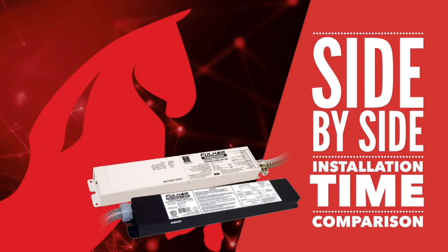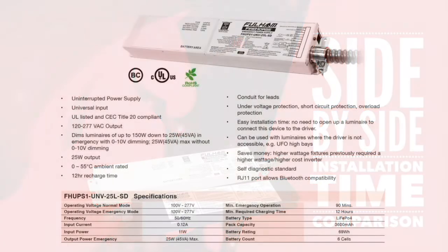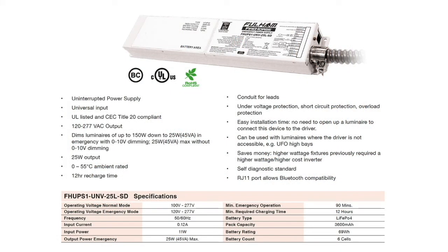Today I'm going to be giving you an overview of our latest product, the FH UPS1 UNV 25L SD. This latest product is a 25 watt inverter that provides 25 watts of constant power output by means of 120 to 277 VAC. It can power any fixture up to 150 watts and will dim the emergency power to 25 watts via the 0 to 10 volt dimming wires in emergency.